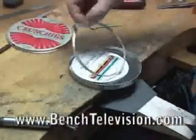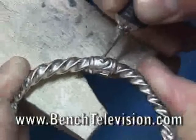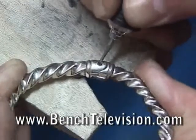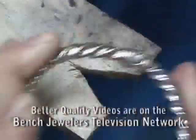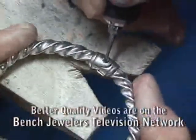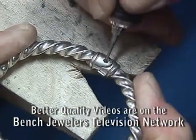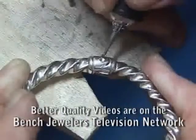The strings from guitars make excellent spring wire. To make this repair, first use a ball burr to grind off the head of the rivet that holds the hinge together. Grind off the head of the rivet and also make a little rounded divot down into the bracelet. This will allow the new rivet head to actually form down into the bracelet, creating a rivet head flush with the bracelet.